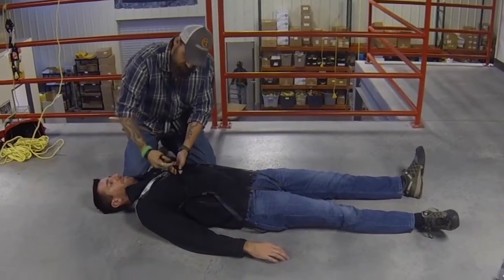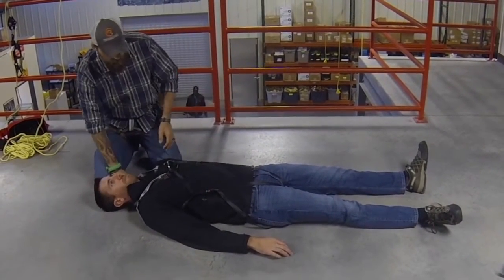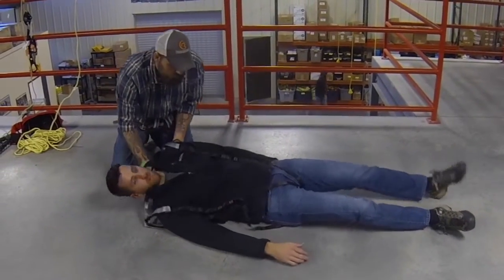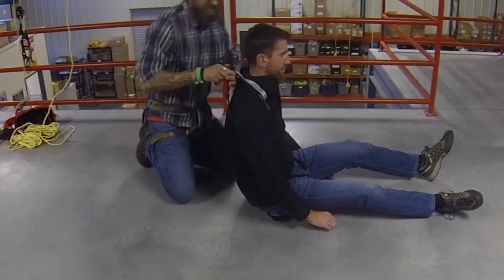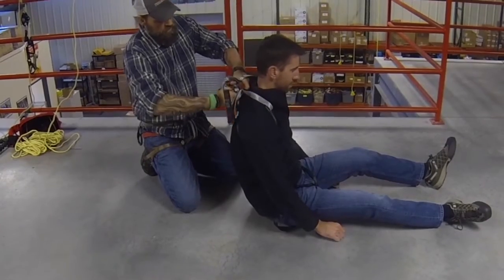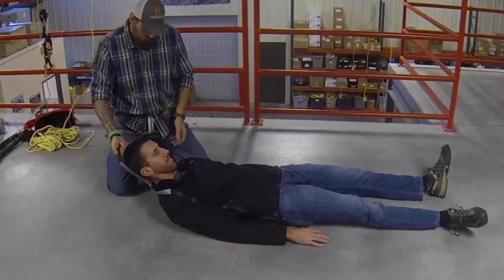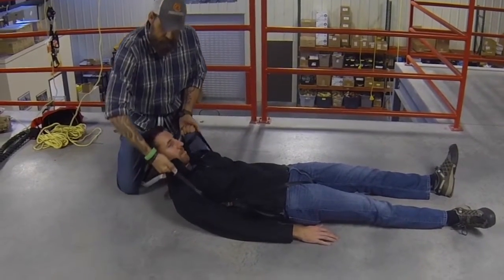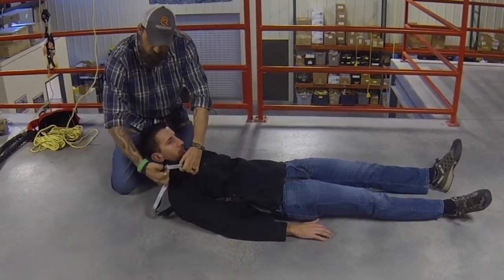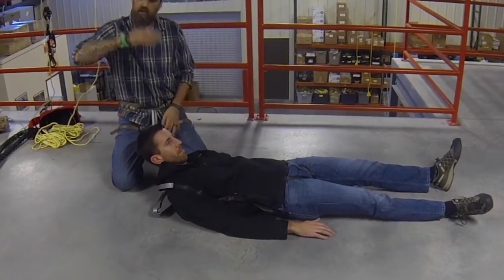To keep them in that harness, I can come in with a non-locker or a regular locker, and then they're packaged and ready to go. This carabiner can also be placed behind the shoulders, which is exactly where we go when we do any kind of hoisting. I can take that carabiner, rig it right through there, and they're ready to be dragged. I can use the handle for a one-person drag, or if we have two people, each person can grab on and do a linear drag. Just to clarify — grabbing just the gray portion is for horizontal only; if we rig anything into the black, then we can go vertical.